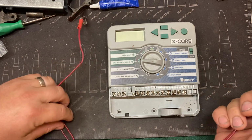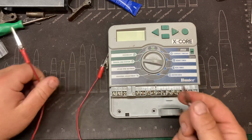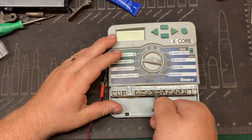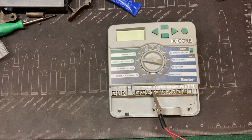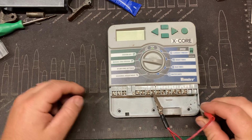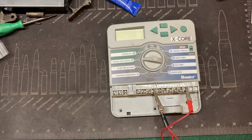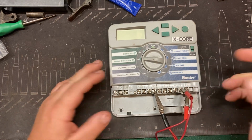So, this one's 3 jumpers. They're just these little alligator clips set up on flexible wire. And you go from the pump, master valve, and then say I got zone 1 running or whatever. And then I'll do zone 6, zone 5. Most residentials I can run 3 with my 185 compressor. Depends on how many heads are zoned.